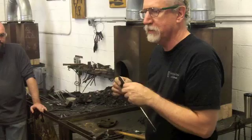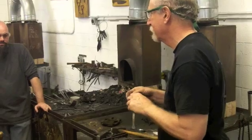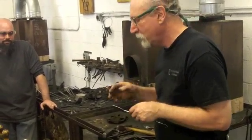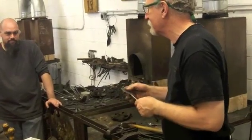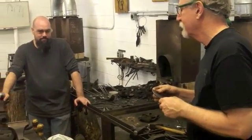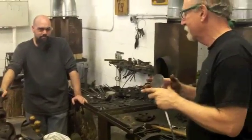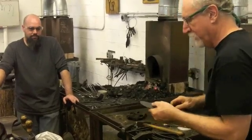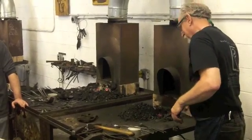You don't want to take multiple heats over and over and over again if you can avoid it. You ought to be able to sink this in 1 or 2 heats. Certainly 3 heats maximum. In 3 heats I can sink a ladle full. But the bottom part of the heat, the last part of the heat on this, it's going to be basically black.